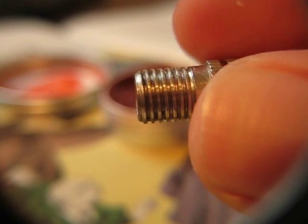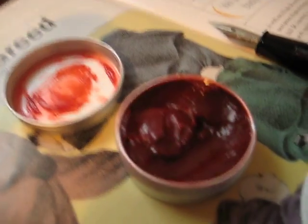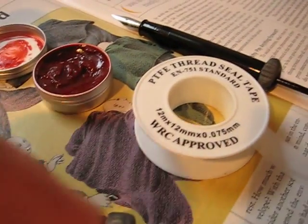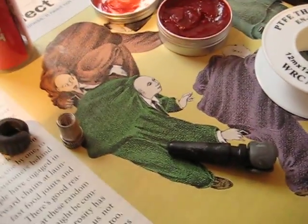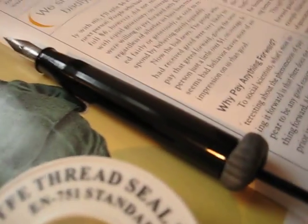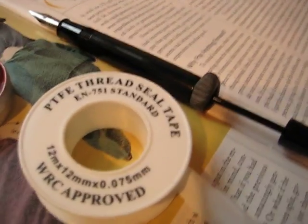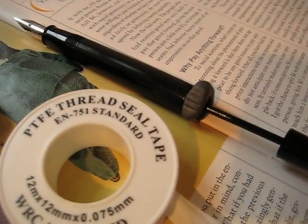Going with metal first obviously made it a bit easier for me, because it's very hard to damage if you clamp it and so on. I will say that for all of the C-rings that I've cast using the red rubber grease and the Teflon tape before applying the epoxy, not a single one has resulted in the epoxy binding to the threads. So I went ahead and did it for the eyedropper and it came away beautifully.